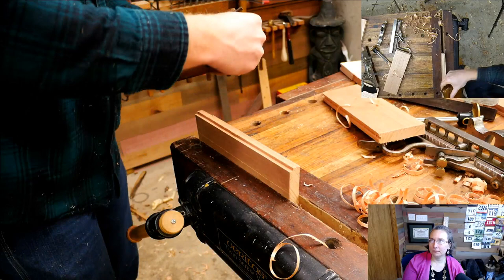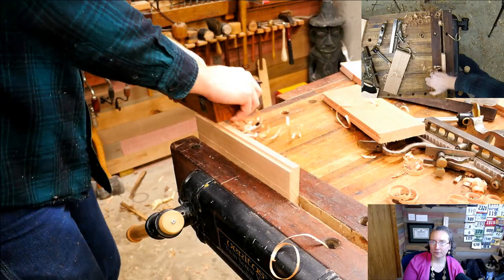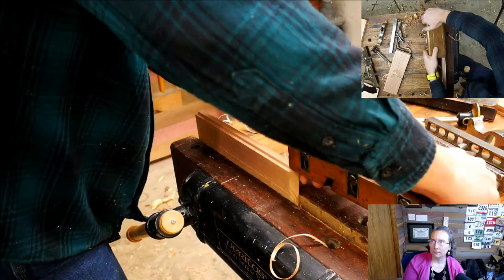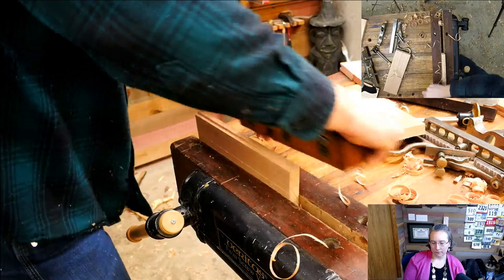The only thing with a half-inch tongue and groove plane is that it's going to be cutting a much smaller tongue, so that tongue will not be as strong. But the tongue and groove joint is not for strength. It's for alignment. So it should not create any issue at all, as long as you don't mind it not being in the middle. What else you got?